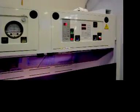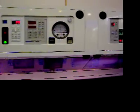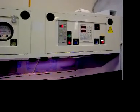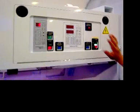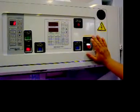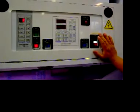This is the bench for TrueSense, modified by WaveFab. There's a couple of features to point out on the temperature controllers that Angel, our electrician, will talk about. Go ahead. Okay, basically we have a bench with a power on-off switch, which is attached to a safety relay, and we have two EMOs, one on the front and one on the back, and they're functional and operational.